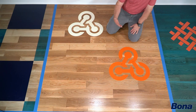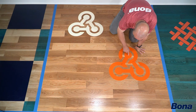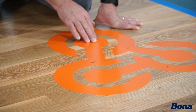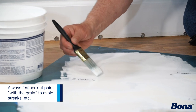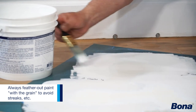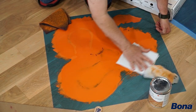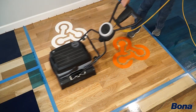Also, a best practice — even if we've got small designs like this that go every which way, you might think you can take your brush, cutting pad, or small roller and just follow the design. Always the best practice is to feather out with the grain. We don't want a chance we're going to leave any lines or striations in our paint, especially if we can do just a couple coats and get good coverage.